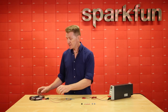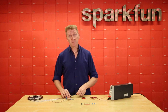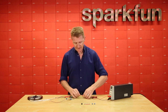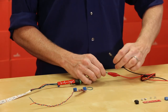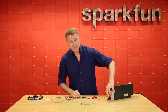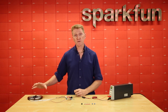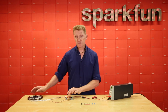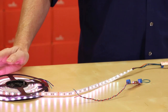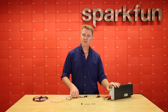I mentioned the PTC fuse, as it's possible to use that on this board, although it doesn't come with the kit. We've got one soldered in here, and what I'm going to do is pump current into this RGB LED string — it's 5 meters. What you'll see first is all three LEDs, red, green, and blue, light up, giving us white. But as the fuse starts to kick in and pull back the current, we're going to lose the green and the blue as they require more current to run than the red. That'll leave us with just red on the strip. There's our white, but as it starts to happen, we fade back to red. It's because our fuse is doing its job.